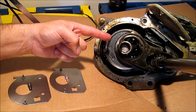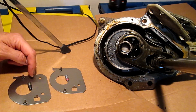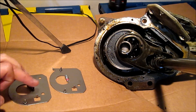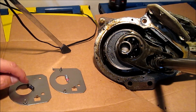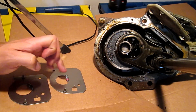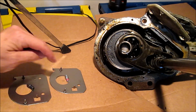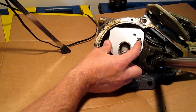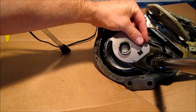We start with all the little pieces taken off. There are two retainer racks. If there's an X on this moon-shaped area, you use the retainer rack with two holes and this larger stud. If there isn't, like mine, you use the retainer rack with one hole and the smaller stud. So you put the retainer rack on here and put in the stud here.